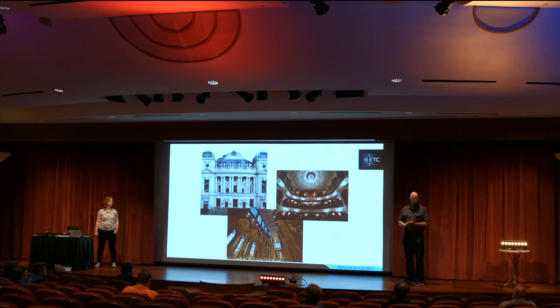So there are a lot of reasons to be confident in wireless and particularly in using wireless DMX. And sometimes it's an absolute necessity. We're talking about retrofitting spaces. If any of you are working in older spaces, venues that have been around for a long time, especially abroad, it is really hard to run new DMX lines through marble. And it is very tricky because people don't want to put conduit on top of these beautiful spaces and mess up the architecture that has been there for decades, if not centuries. So wireless DMX in particular and wireless networking in general are things that are sometimes important just in making the potential of your space available to you as you continue to develop your lighting system.